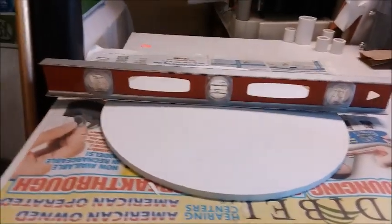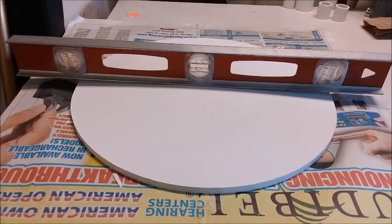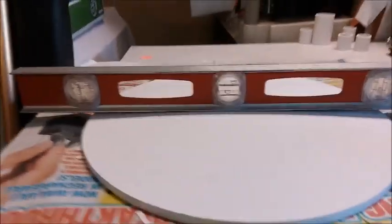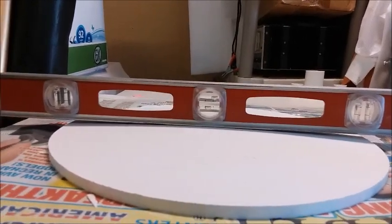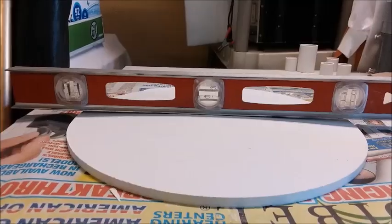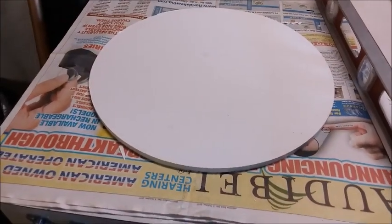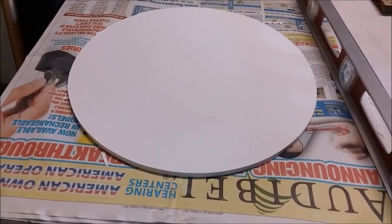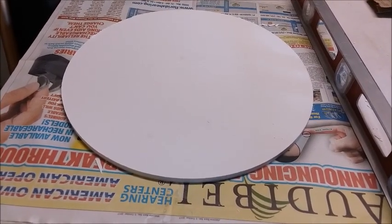You can see how much curvature it has. I was aiming for 16-inch F3.5 — we'll see what it actually turned out to be. The foam isn't all that rigid, and sometimes I don't hit exactly the target. But it's got a pretty strong curve to it, so it's probably close to F3.5. This needs to dry out completely. I may put it in the kiln at low temperature to dry it out, and once it's good and dry it's ready for firing. I'll set a circle of 16-inch glass on top of it, fire it up to slumping temperature, and let it slump down over the mold. I haven't tried one this big yet, but it should be straightforward — I've done a lot of smaller ones.